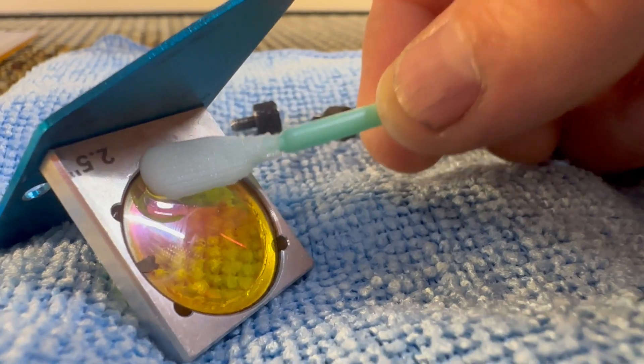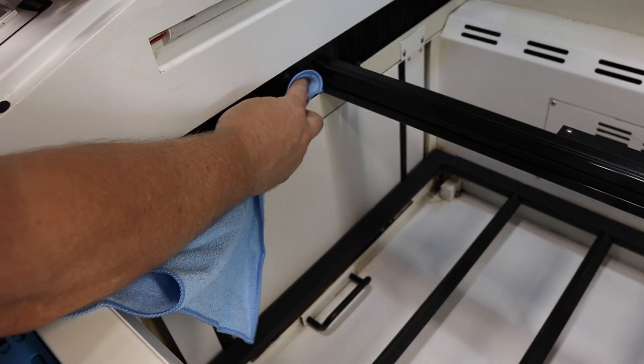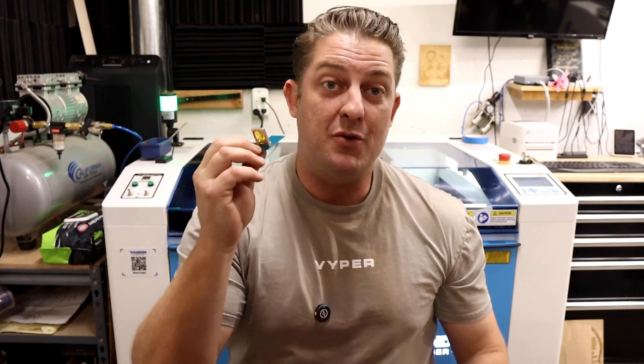The lens is cleaned in a similar way and is easily removed and reinstalled with a couple of thumbscrews. Inspect the lens for any debris, blow it off if necessary, then clean with a few drops of alcohol in the same manner as the mirrors. Don't forget to clean the lens window inside the machine and also the beam combiner in the back if you're working on one of the other Bolt machines. On the Bolt Pro 32, the beam combiner is totally enclosed in the back of the machine. It's really good practice to have a spare set of mirrors and an extra focus lens on hand — that way, if something happens to your optics, you can keep on running without missing a beat.